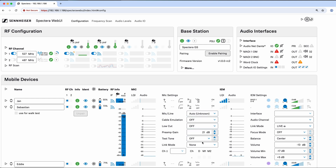You'll be able to see your audio level of the microphone once a microphone mode is enabled. Under microphone settings, you can change the auto detection so it can auto detect whether it's a mic or line input, or you can force it to be either mic or line. You have the ability to add cable emulation of short, medium, or long cables to emulate different guitar or instrument cable lengths. You also have a low cut filter that you can change depending on the source. You have the preamp gain — you can enter any gain you want, for example 5 dB, or go up and down in 1 dB increments using the arrows. A test tone is available with adjustable volume, and presets are provided.